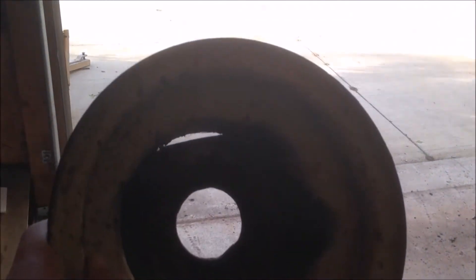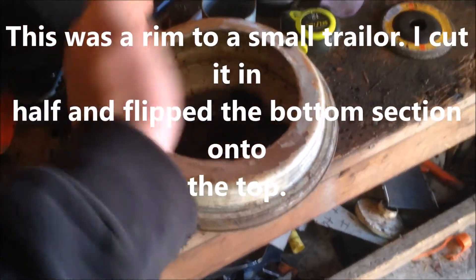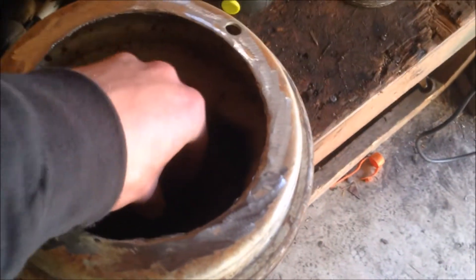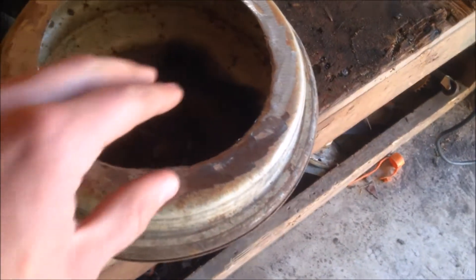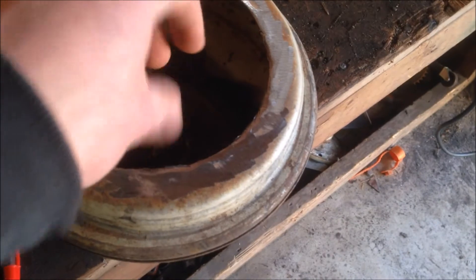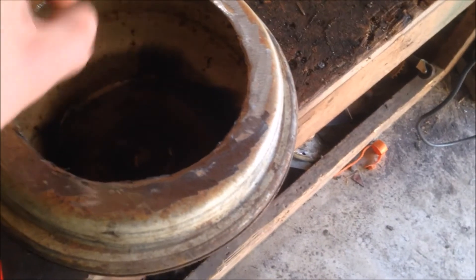What I have so far is a little bit crudely made but it'll work just fine. This is the beginning of my hearth zone - it'll look kind of like this and it'll have an inverted cone inside, about 5.25 inches tall. That will be where the actual combustion takes place. There'll be a little air nozzle that comes off the side, points down into there, and the air gets blasted right on top of the wood.